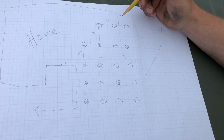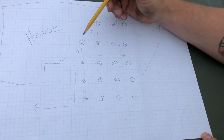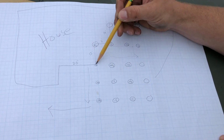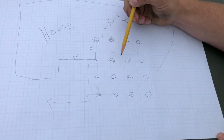So that's when we need to look at each spot and see if there's any issues. A lot of times you can see if there's standing water. That's a dead giveaway, but sometimes there's not. So in this circumstance, here's where we zeroed the grade out. Then from this point to this point, it drops 10.5 inches, but then it goes up here.